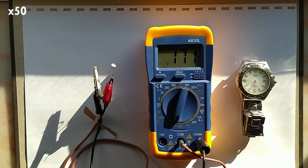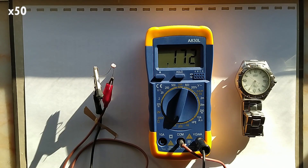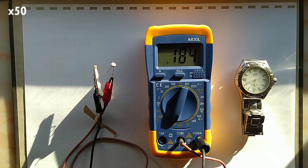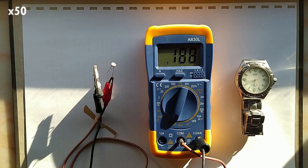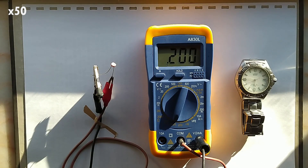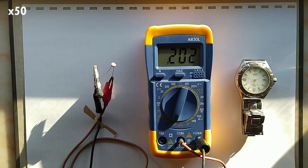The sky is completely open with no clouds, and in this time lapse of 30 minutes we can see the variation of the resistance is very low. Because there are no clouds, the intensity of the light hitting the photoresistor changes very little.